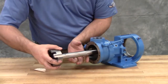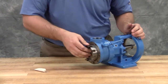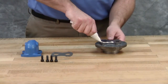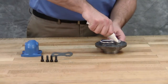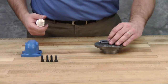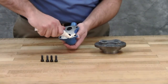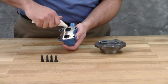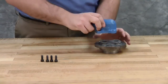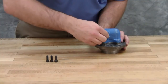Slide the rotor and shaft assembly into the casing. Install relief valve gaskets onto the head — use a gasket sealant if available. Be sure that the end of the relief valve points in the same direction as when it was removed, toward the suction port of the pump. Attach the relief valve onto the head and install and tighten the socket head cap screws.